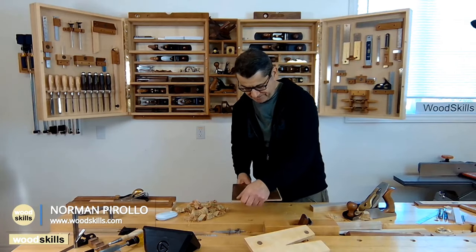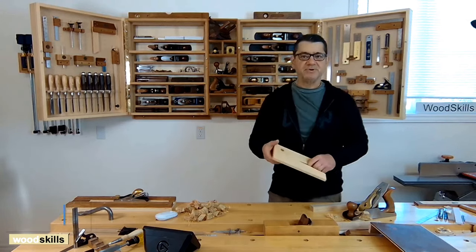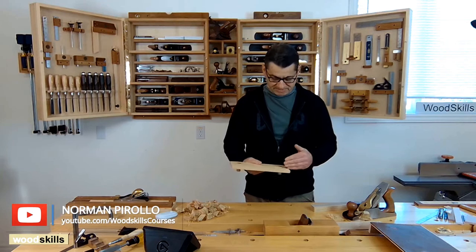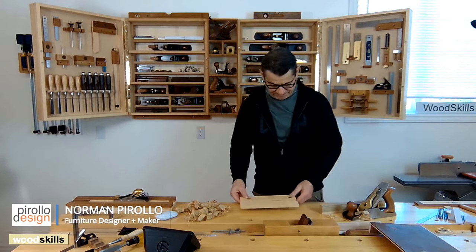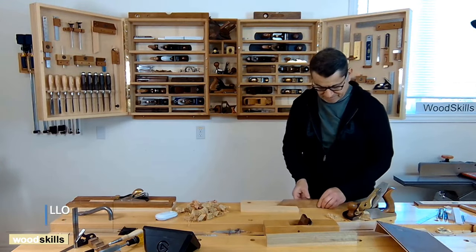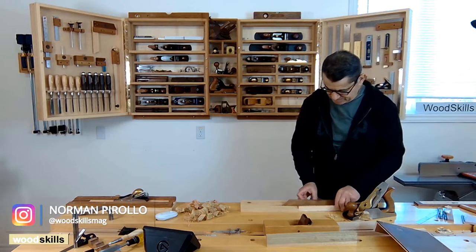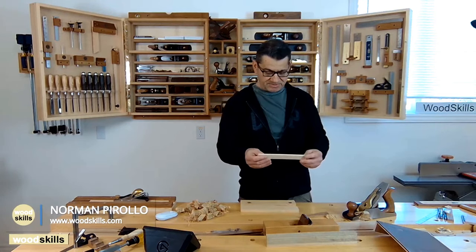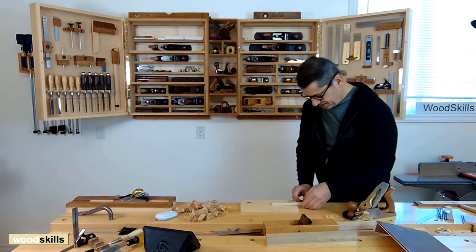Next I'll remove this accessory and demonstrate the bird's mouth. The bird's mouth is another plug-in workbench accessory using the same system of two dowels. It allows me to lock a board on edge, because it's very difficult to hand plane narrow boards on edge unless they're fastened in a vise. I use two little wedges to lock the board in. This is a good example of a difficult board to plane on edge — it's very narrow and hard to keep stable without a vise.